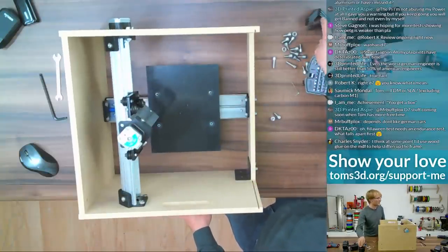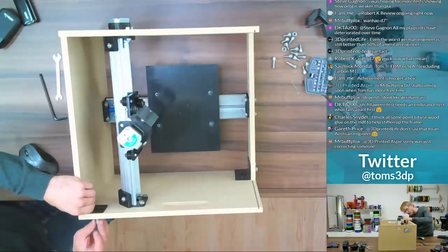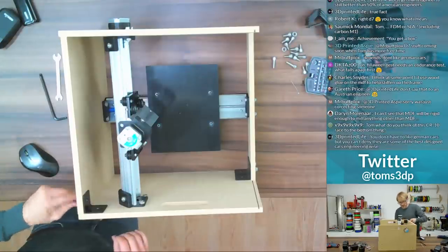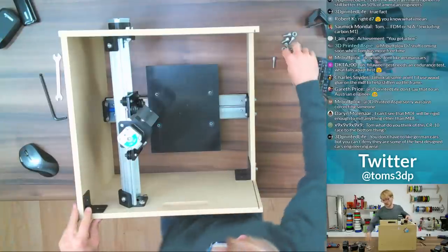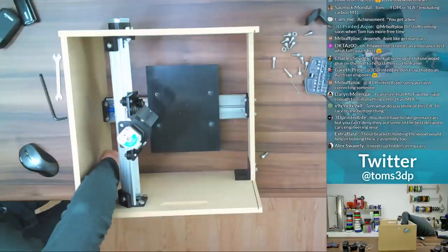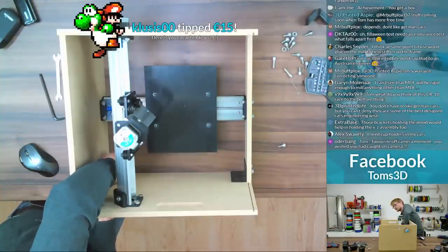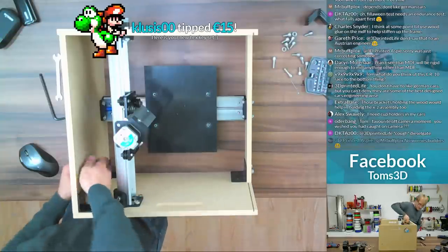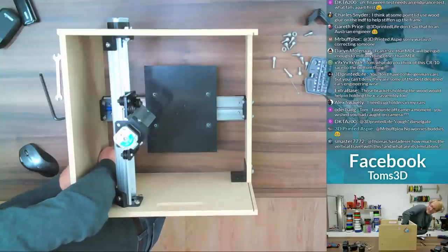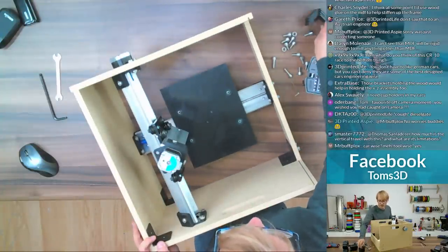So for context, the discussion on long-term durability and resistance of 3D printed parts highly depends on the material, I'd say. SLA versus FDM is going to have a huge difference in what the finished print is going to be able to take as far as UV and the chemicals go. But also, if you're just printing FDM, there's a huge difference in the fine details of what materials you use. I've had an ABS part in direct sunlight for a while, and it looks good like new, because I use black ABS and that just absorbs any UV.